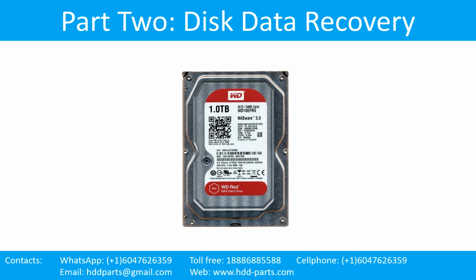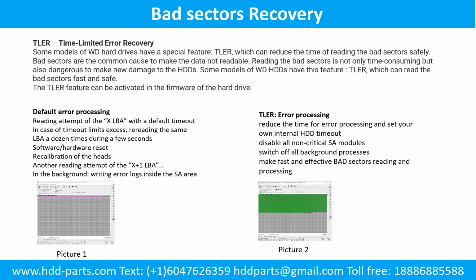Part 2. Disk data recovery. Bad sectors recovery. Some models of WD hard drives have a special feature called TLER, Time Limited Error Recovery, which can reduce the time of reading the bad sectors safely. Bad sectors are a common cause of data not being readable. Reading the bad sectors is not only time-consuming, but also dangerous, as it may cause new damage to the hard drives. Some models of WD hard drives have this TLER feature, which can read the bad sectors fast and safely. The TLER feature can be activated in the firmware of the hard drive.